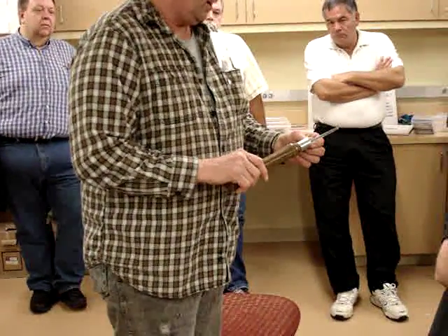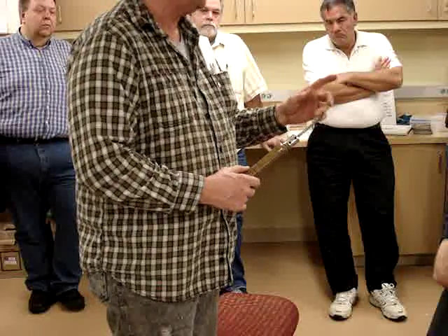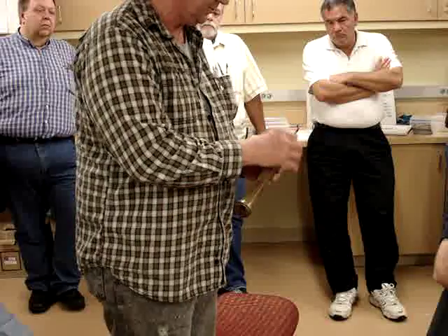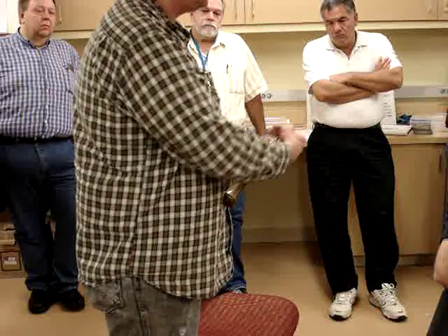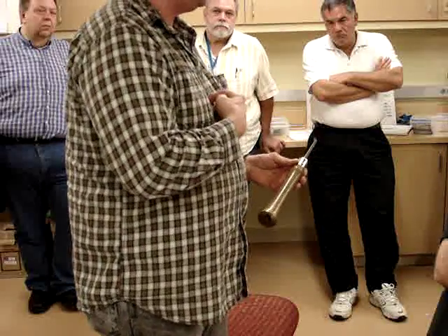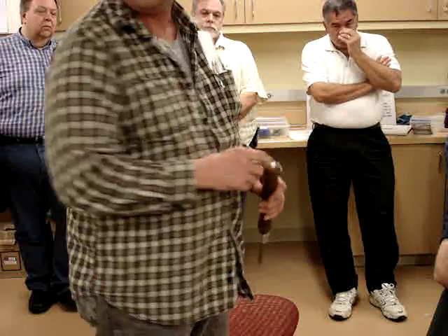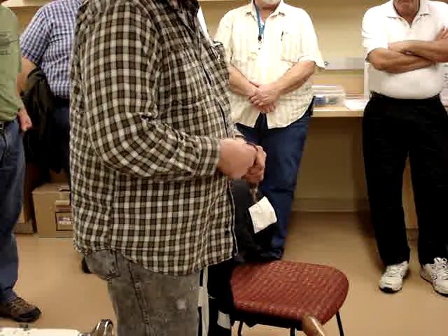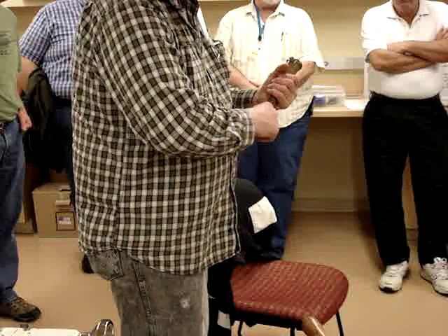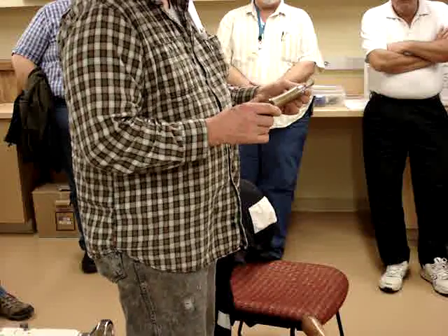Here's another simple tool — a homemade piece of bar stock with one of those aluminum ferrules tightened with allen wrenches that tighten the tool up. You can drill right through the handle and it'll disappear right into it if you have a straight piece. The thing I'm always worried about is losing the allen wrenches — it annoys me not having them right there when I need them. So I went overboard: I have an allen wrench in the bottom here, drilled a hole in it. You turn this to the side, it kicks out the allen wrench, which is held in there with a little magnet. Dandy little allen wrench holder.